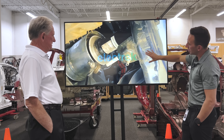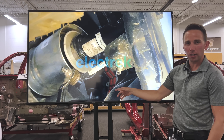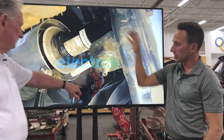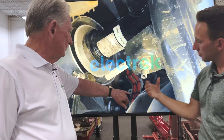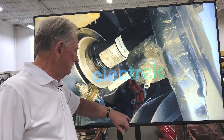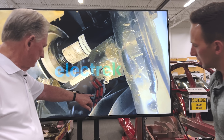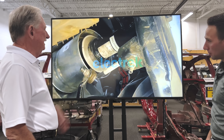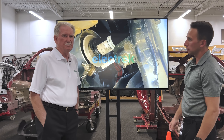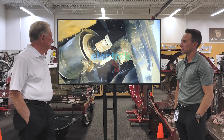What I find interesting is we've got an air bag here with an aluminum shield around it, and high voltage cables running underbody. Most OEMs would cover this completely — shield it, especially in an off-road application. I don't know whether somebody took a shield off or something, but that's obviously a track for the high voltage. There might be a stud on the body — often these get pushed over, the stud goes through, but there's no nut or anything. At the end of the day, there might be more going on here, but we think this is definitely a prototype, and sometimes prototypes don't get all of their parts.